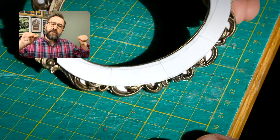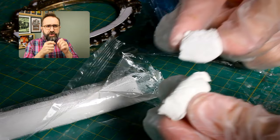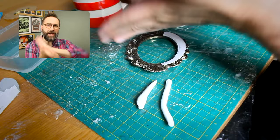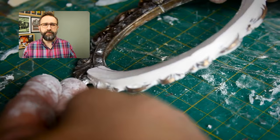A piece of smooth cardboard to make a plaque for the characters to be stuck to. Then I'm using Milliput for the first time - this is the super fine, very smooth variety. You cut off equal parts hardener and resin, and it tells you to mould them together for seven minutes - which I really like as precise instructions. So you smush, fold, and squish for seven minutes. You make a nice long white worm, put it into the gap, and it's as smooth as plaster when dry and rock hard.